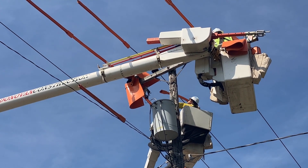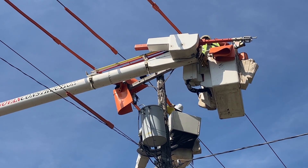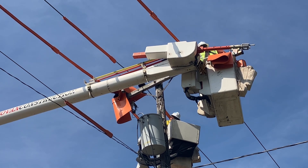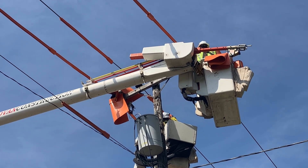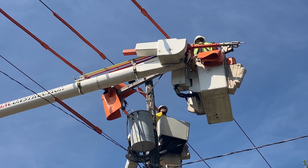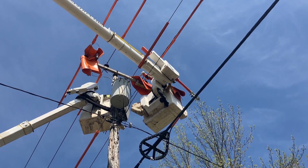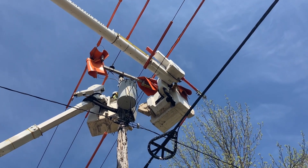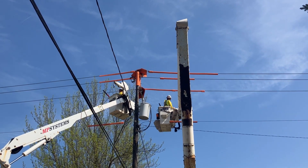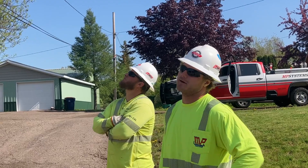We also have an arrestor up there, and we'll have to mack that out, mack the transformer to spread it. Would you want to cut that ground open and isolate that? I'd love to isolate that. Okay, so we'll eliminate that hazard. Blankets on the arm, blanket everything. Depending on where the mack lands, keep it away from the grounded tub. Trying to find a proper length mack.